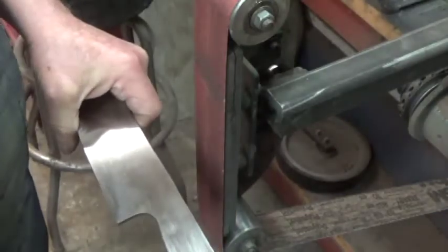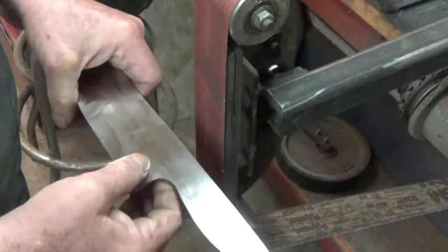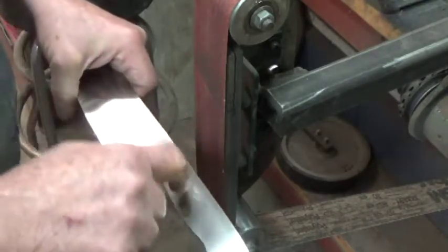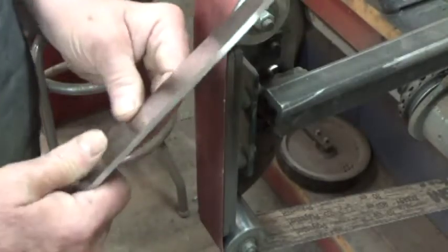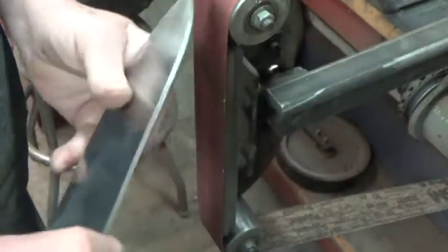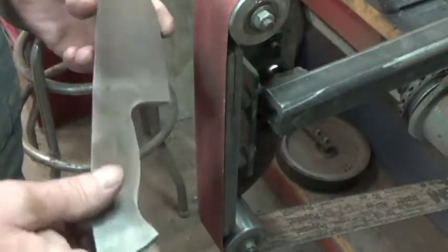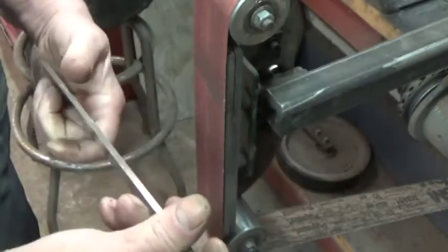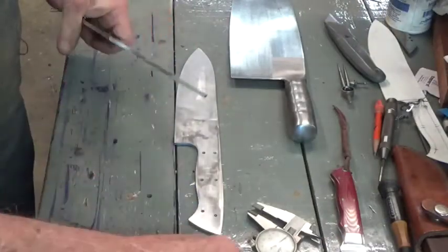I've gotten this to the point where it feels relatively flat. The only area I'm worried about keeping parallel on this knife is right up in here - there will be a flat just after the plunge cut and before the handle material. That gives me a reference to grip so I can drill my holes through the handle material, because this tang will be tapered. The blade is going to lose a lot of weight going forward as we bevel it down to a cutting edge, so although it's starting out pretty thick, it's going to go on a weight loss program really fast.